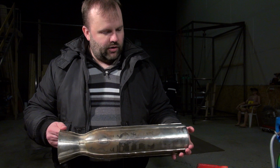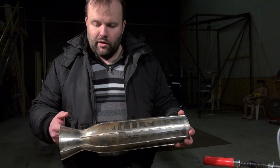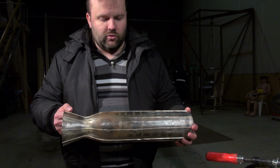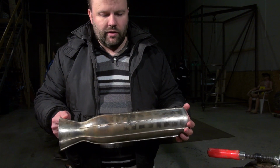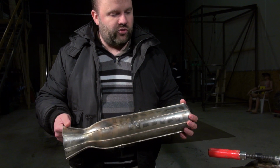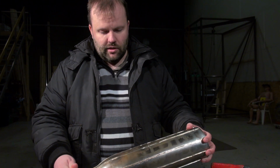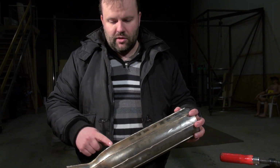This is a BPM-5 inner liner with 8 spacers soldered to the surface. The silver soldering process worked very well. We have full attachment underneath each of these copper strands.